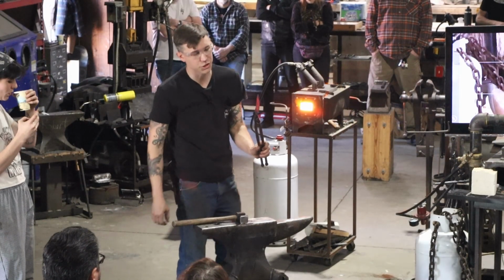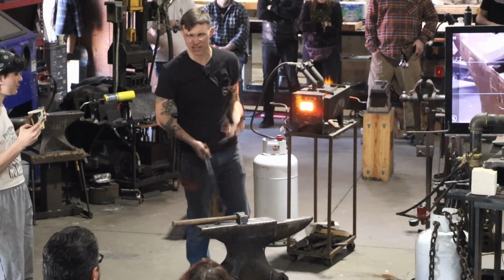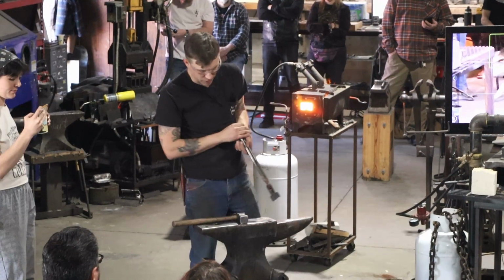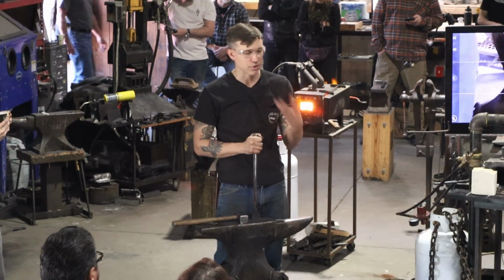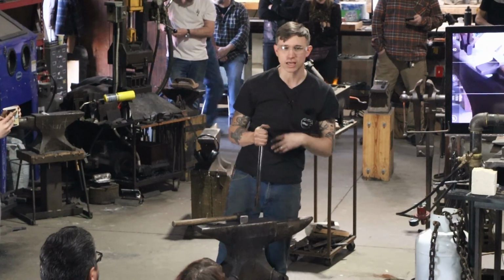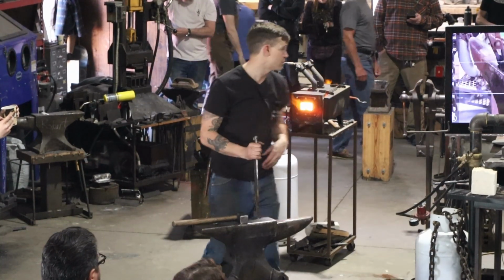So another indication that I'm getting into a good thickness is that even when it's hot, it's really resisting me. It's bouncing up because when it gets really thin like that, it's just really harder to forge. But we just have to be willing to, like the first 2 heats, I can probably do more technical material removal than the next 5 or 6.